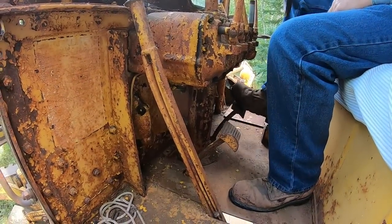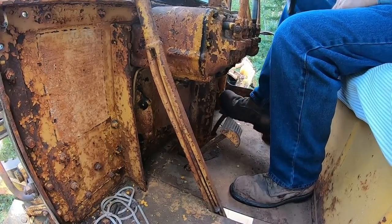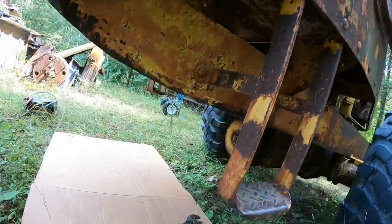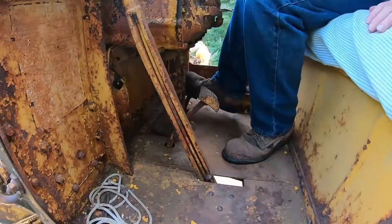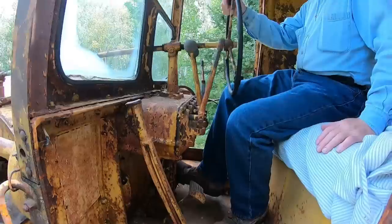I don't have a pedal. Is it coming up at all? Yeah, it's pumping up. It's a little higher every one. Nothing leaking. She ain't fading down. She's holding. Should we just go with it and see how it...